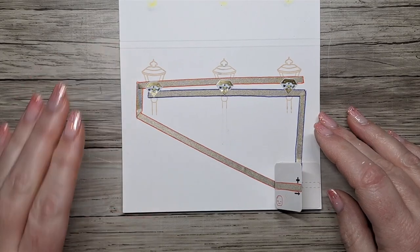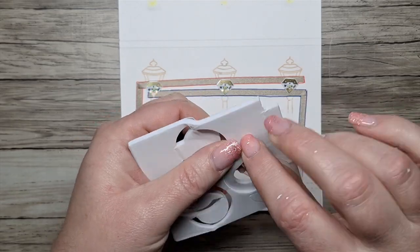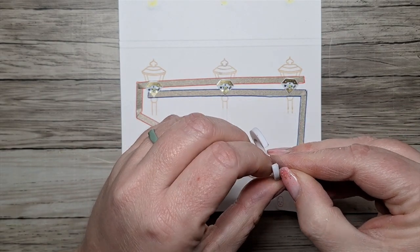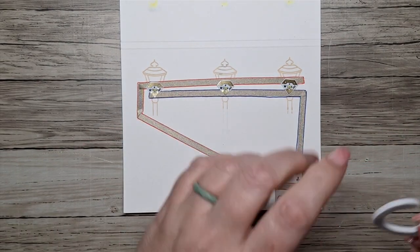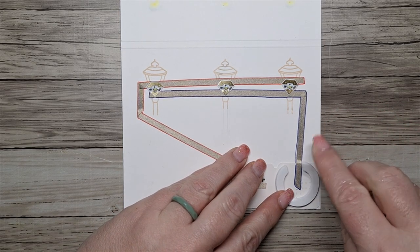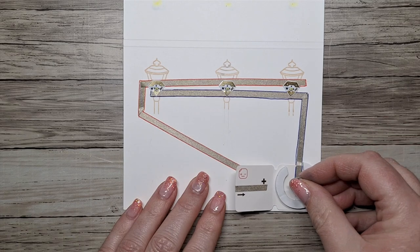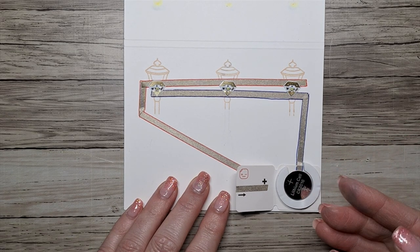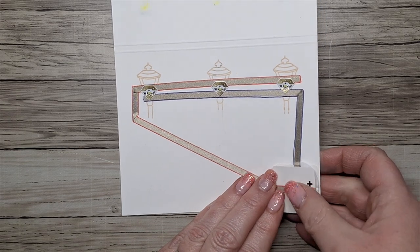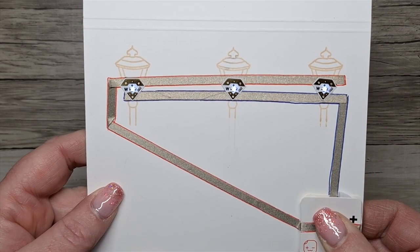We have one more little job to do. We're going to bring in the C-shaped foam to go along with our battery holder. And this is double-sided sticky. Just peel it off. I'm going to start by peeling one backer off that C-shape, and you're just going to tuck it inside the folded battery holder here. Try not to get it stuck to my fingers. Then you're going to take a 3-volt coin battery and drop it in that C shape. And for you at home, you're going to peel this off and stick this closed. This becomes the switch to your circuit, and by pressing down on the switch, it activates your lights.